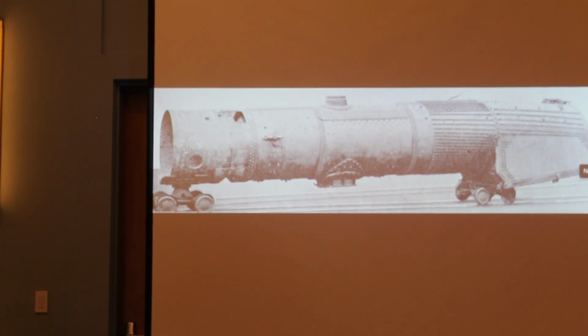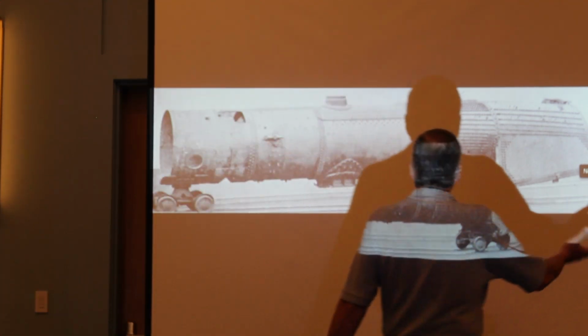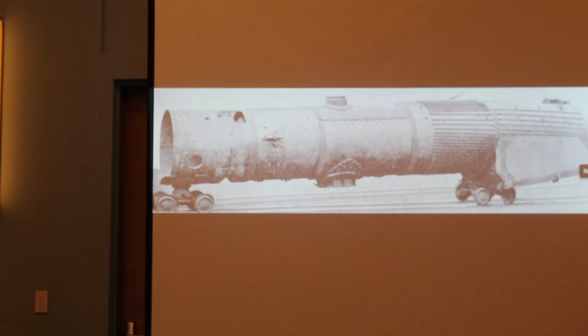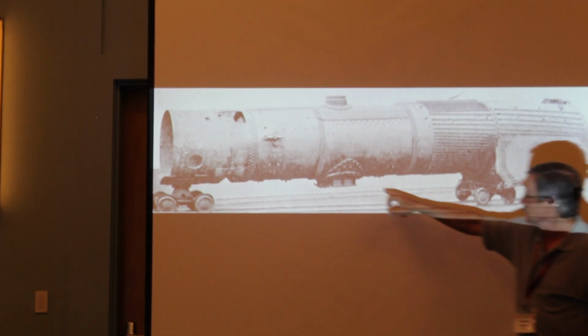It wasn't until after World War II, for obvious reasons, that all welded locomotive boilers became available, after the American Locomotive Company proved out the all welded boiler and promoted them heavily. American Locomotive Company had a furnace big enough to put an entire boiler in. They wouldn't do it in this position, where all these bolts are already applied. You don't want to put a boiler with all the stay bolts in it in a furnace, with rivets down at the mudring and a few other places.